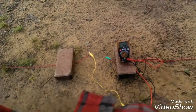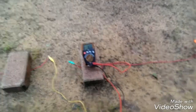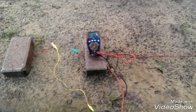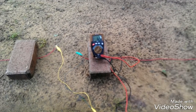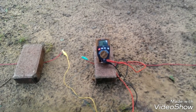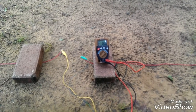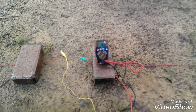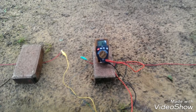Tonight or tomorrow when we get up, we're going to actually graph this out. Make sure you put a positive or negative sign — at least mark negative readings. Your readings may be totally different from mine depending on where you are and what's going on in your field. Throughout the day you may see rapid changes or slow fluctuations up and down — those are called ultra low frequency waves. These probes, as simple as they are, are very sensitive to the field around them. Do not step around your probes or touch them — it's going to induce a voltage and ruin your readings.